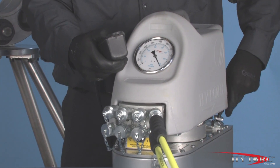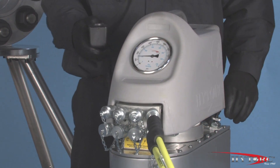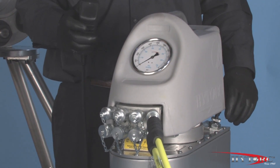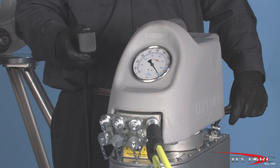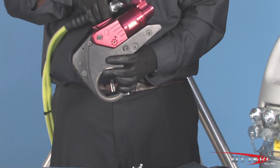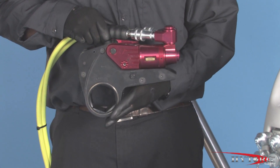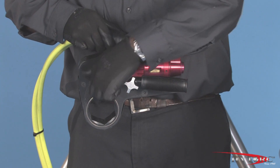When removing a nut or bolt, we are not concerned with an exact torque value, only that our tool has sufficient power to break it loose. Turn the pressure on the pump to at or near maximum, giving the wrench its full power. Reverse the direction of the XLCT by simply turning it over, so that when the piston advances, it will turn the nut in a counter-clockwise direction.